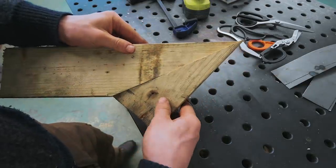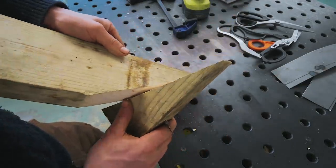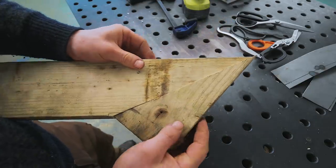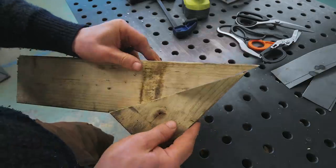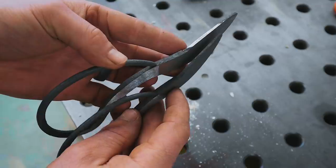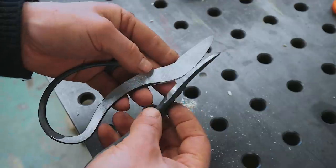I thought something funny would happen. If you pivot on a taper, this surface rotates out and then you create a gap. You can't pivot on a taper — not with them being riveted, it's just not going to work. So that means I've got an issue, and it's of extreme importance that my pivot area is not only flat, but parallel, without any taper.